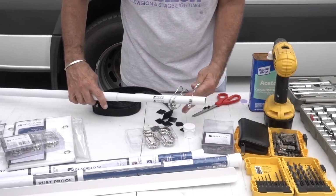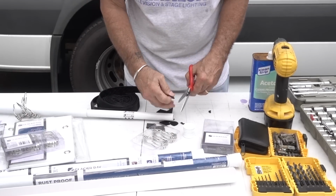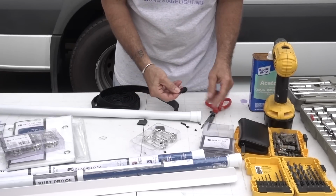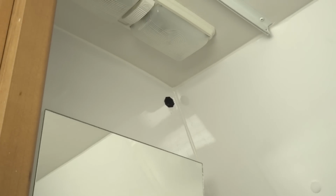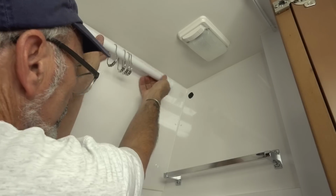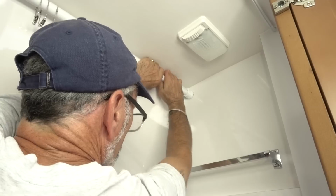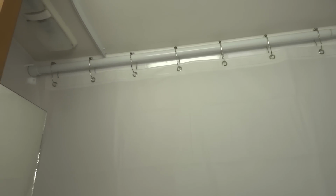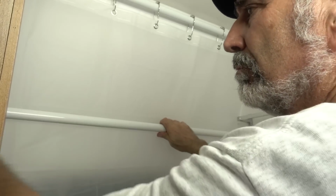Okay, here we go, next step. Sling your curtain clips onto 2 of the rods, and cut little Velcro circles for the ends of all 3 rods. See how the little Velcro circles are positioned on the wall? So when you jam your shower rod up in there and tighten it, the Velcro will lock it in place. Locate the rod as high up into the corner of the wall on each side of the shower room. Just be aware that the rolling curtain clips need to clear the old shower track on both sides.